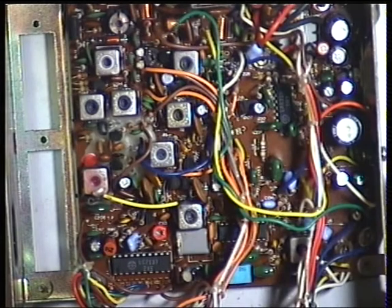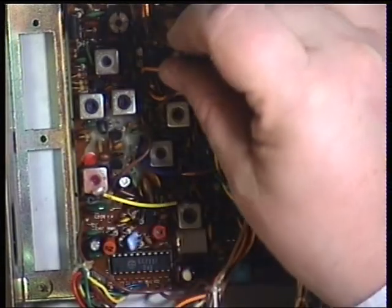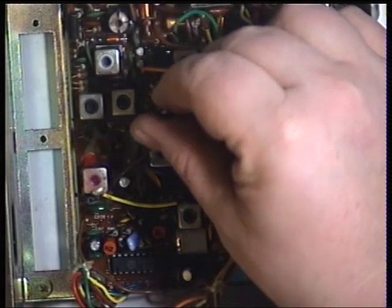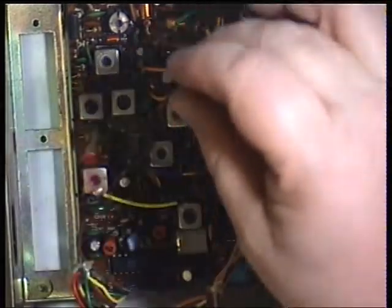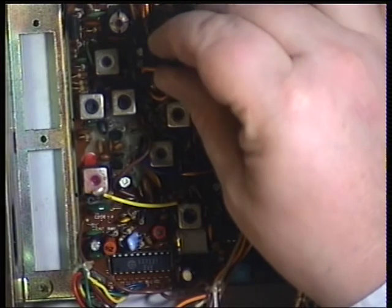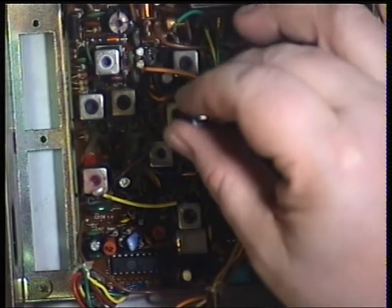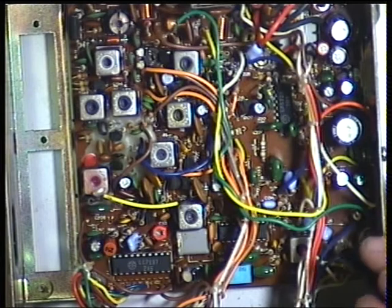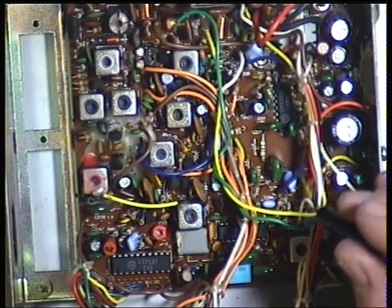That's brought it up considerably. Yeah, it's just been faffed around with then by the sounds of it. So I'm backtracking on those two. I've gone back to those 3 times, and we've now got actually 0.6 of a microvolt. So the radio is now usable.